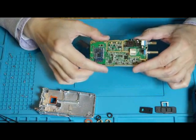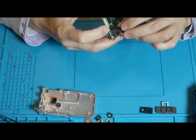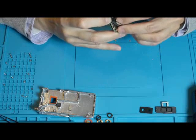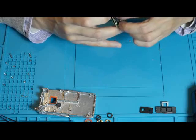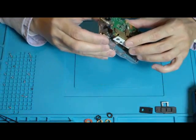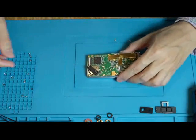Now he's going to be moving the remote antenna over to the other side of the board. There is a small notch at the bottom of this PC board which allows the antenna wire to not be broken when you put it back in the case. The antenna is held in with double-sided tape — a piece of foam. He's setting that down and making sure the wire is formed so it stays in the slot. You'll check that when you put the unit back onto the metal case. He's now reassembling the printed circuit board to the metal case, and the module is installed, as is the antenna.